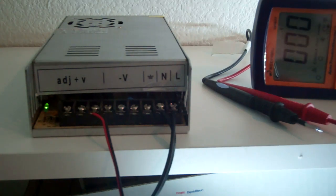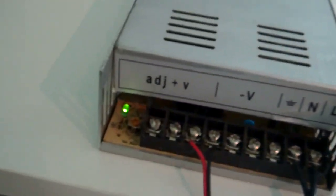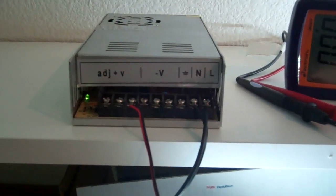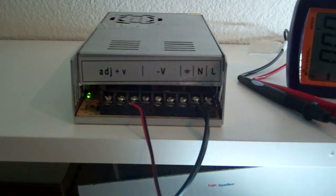I'm going to show you where you make your adjustments first. To make a voltage adjustment, there's usually a little indicator. It might be kind of tough to read, but right here it says 'VO adjustment' — voltage adjustment — and there's a screw here that we're going to adjust. The green LED light tells us that there's power to the unit.